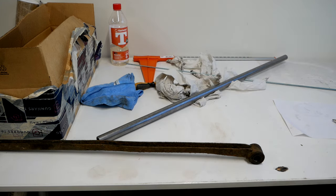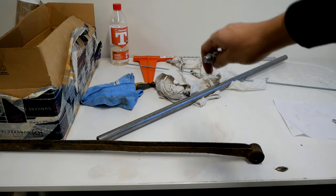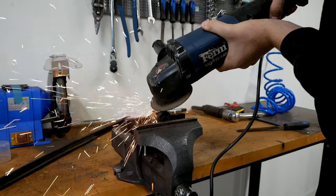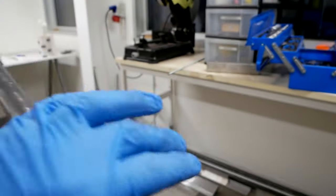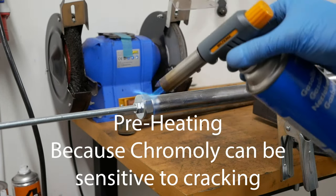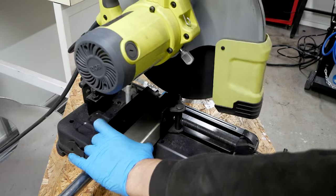I want the longest setting — when the rod is at its longest — to be similar to the OEM one, because we need to shorten it when we lower the car, so the longest setting is kind of like OEM and then you can shorten it from there and fit it perfectly. I'm going to spot weld the internal thread fitting to the tube with my TIG welder, and in order to not let the heat warp it out of alignment I'm using a threaded rod through the entire thing and clamping it down. The final welding will be done with my MIG welder after I've test fitted it to the car and made sure it fits properly.